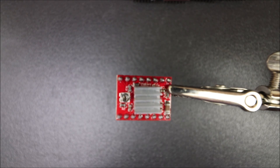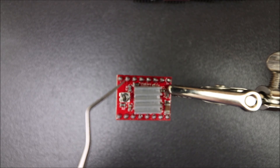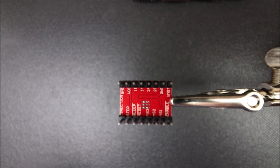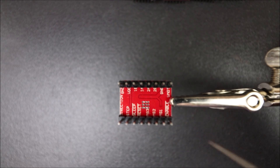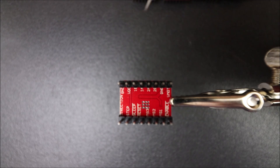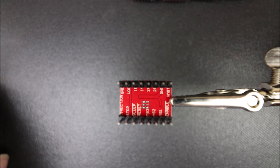This is the top side of the A4988. We have a trim pot and cooling aluminum that wicks away heat from the chip. If you look closely on the underside, you'll find pin names. On the underside, we have enable written here associated with this pin, then our ground pin, and our direction pin. I'm going to show you the other chip and explain it as well.